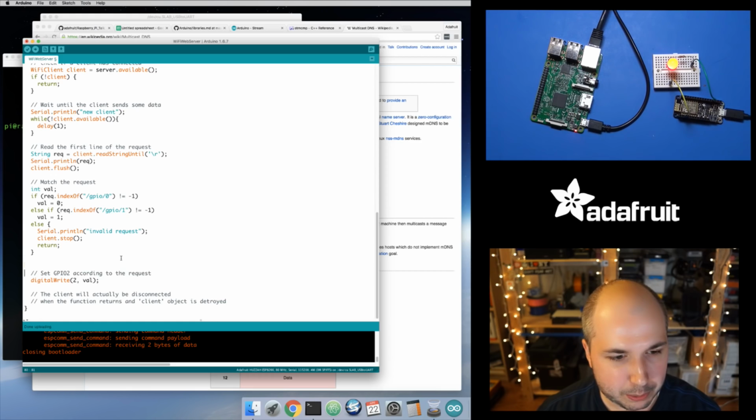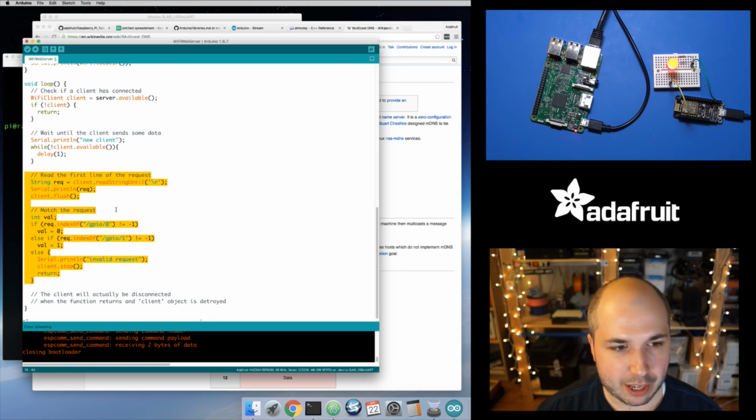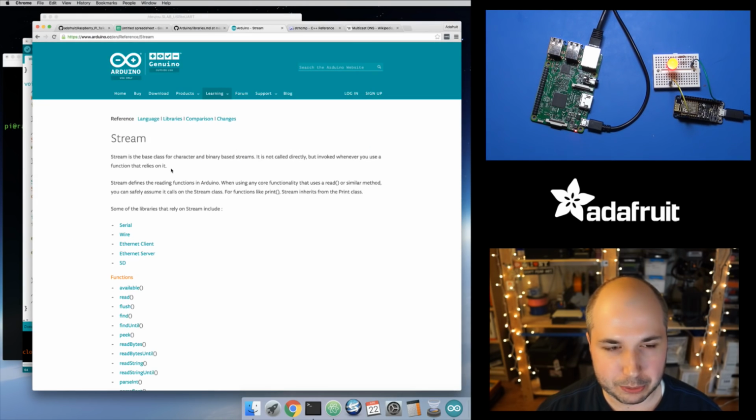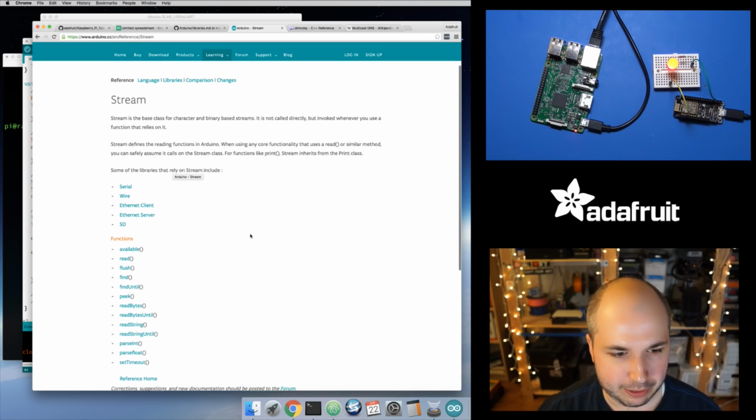The GPIO, I'm going to remove this for now just because we'll put it in our code for turning the LED on and off. Matching the request, I'm going to show a different way. So in general, in how they're doing the string processing here, they're using this readStringUntil function, and this is a part of the Arduino Stream class. And again, I'll put a link in the description below. This is the documentation for it.